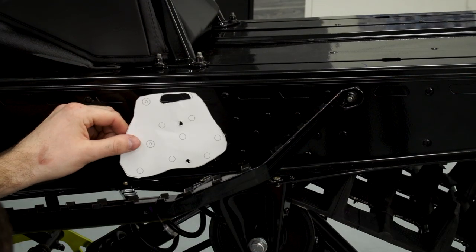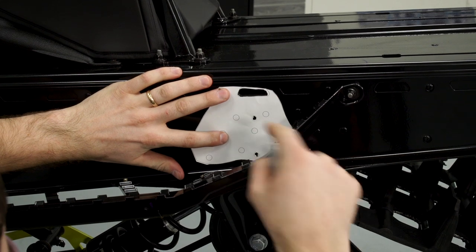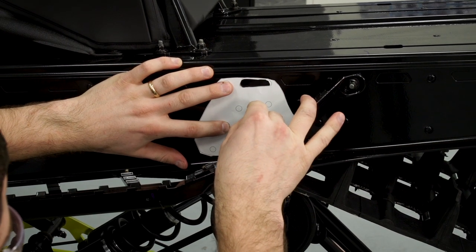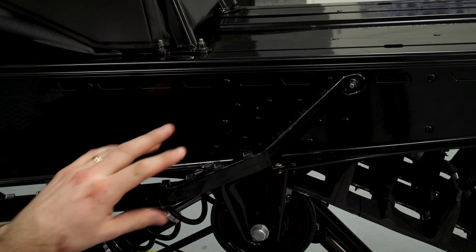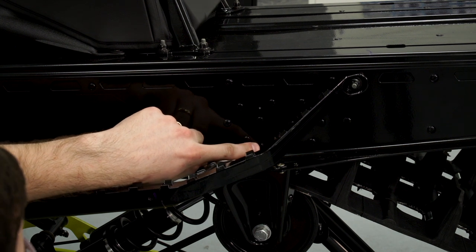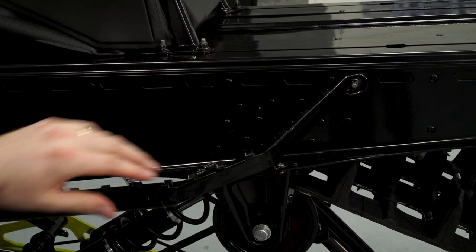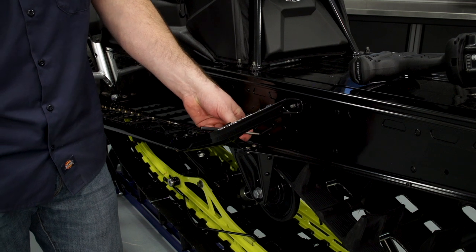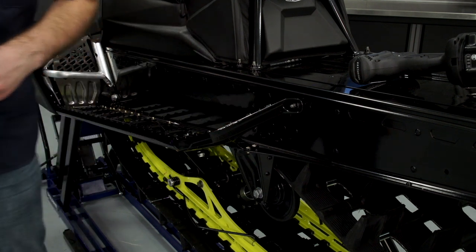Next, we're going to drill the holes for the front mounting bracket. In the same manner as we did with the rear, we'll put the template onto the machine lining up the rivets and the cutout in the tunnel, and then mark the upper and lower bolt locations. It's important to note that the running board may be in the way to drill the lower hole. We'll need to mark that lower hole with a small pilot bit and drill through from the back side. The upper hole we can drill just like we did on the rear. I'll lightly mark the lower hole with a center punch, as it's in a pretty difficult location to drill.